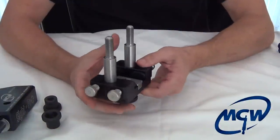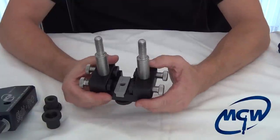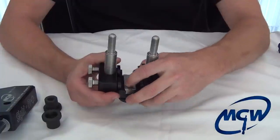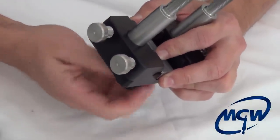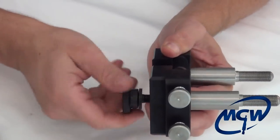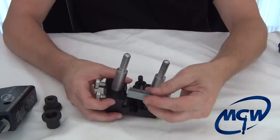We can do it with our hands here and we're going to show you how. The only thing that is interchangeable on these tools is this one component — the clamp shoe. I'll take this out and show you how it works. It's held in with this one thumb nut on the bottom.